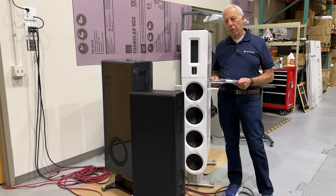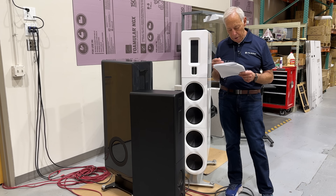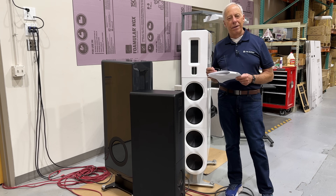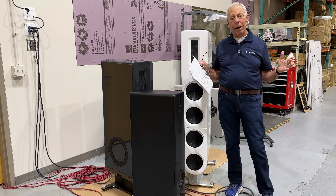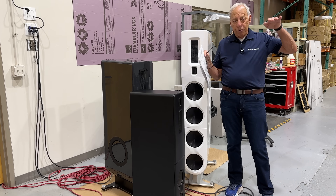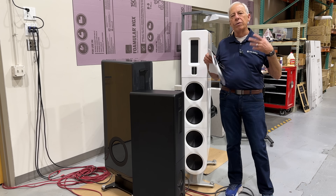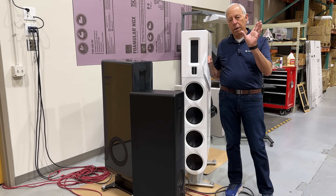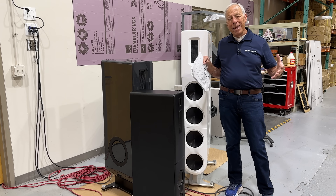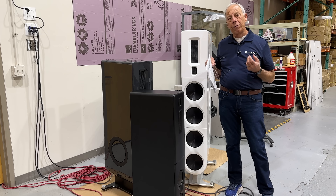Your friend who told you that in order to cover the power requirements of your USA-bought amplifier, he's correct. Absolutely correct. In fact, a step-down transformer only puts out a certain amount of power, and you have to have one that puts out enough power — in fact, more than enough power — so that it's not dropping the voltage. Because what will happen when you draw power: when your power amplifier starts drawing 100 watts, 200 watts, if your step-down transformer isn't big enough, the voltage is going to start dropping because it can't supply the same voltage when the current draw is heavy.